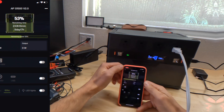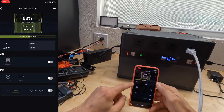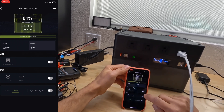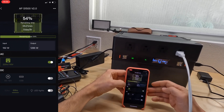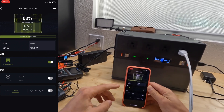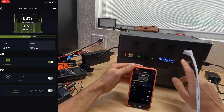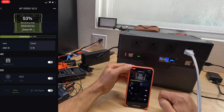It works fine. While using the app I noticed an interesting charging problem. We're charging with the 300-watt power supply but the input is jumping between 260 and 286 watts. When I activate the AC outlet with a space heater attached, input drops to about 200 watts — only about 60 percent of available charging speed. Sometimes it drops to 50 watts or even disconnects and restarts. As soon as I disable the AC outlet, charging input goes back up to 286 watts.